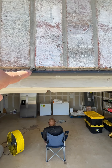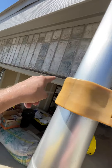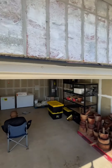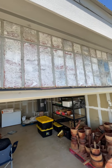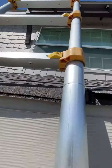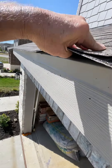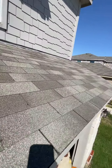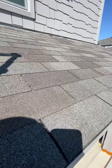This is the garage space over the garage car entry. This is the lintel, and the lintels are supposed to be painted to help protect them from rusting. These are weep holes — a good thing to have — but they're not painted, and so that's going to start rusting right there. The rust is going to cause the metal to expand, and the metal expanding is going to cause the brick mortar to crack.